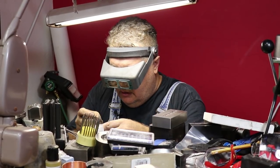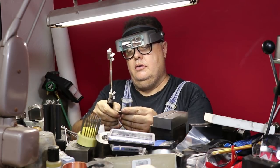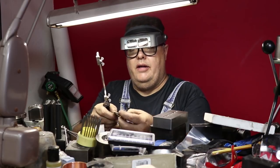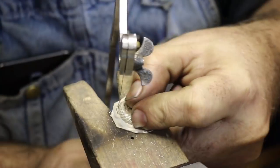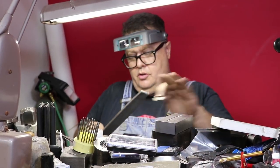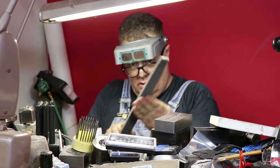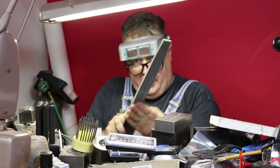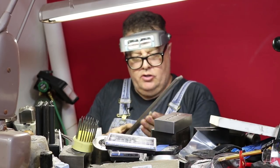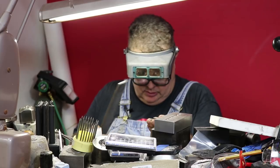Those look really good. I'm going to use my saw — I'm not going to cut out exactly to the edge, I'm going to leave a little bit of an edge because I'm going to show you how to solder a back on this. I really like some of these giant files — I think they're practically for horseshoes. I'm going to file the back because I want the entire edge, the back of this thing, to be dead flat. That's going to make it very easy to solder this together.